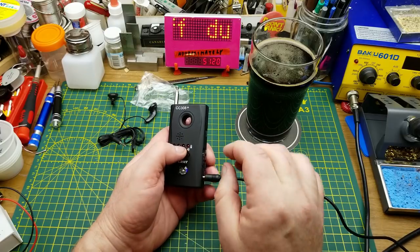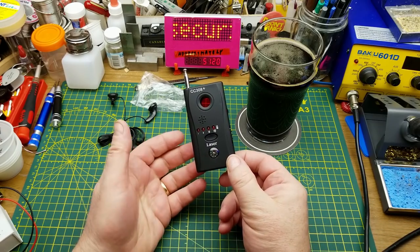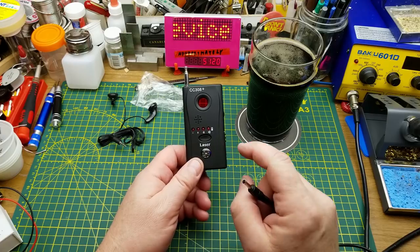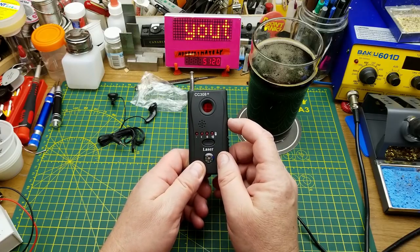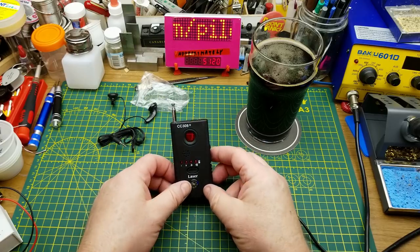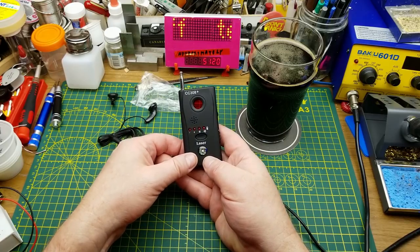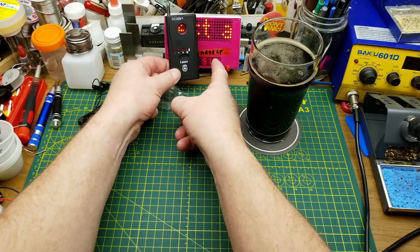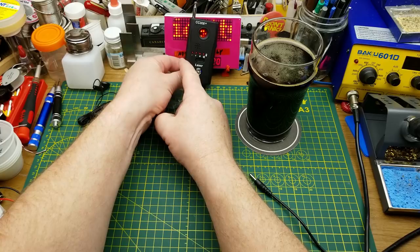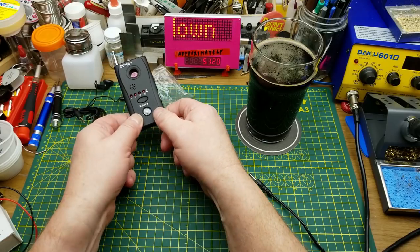When it's plugged into its charger and I turn it on, it's detecting full tilt. When I unplug the charger it calms right down — so its own charger is either noisy enough to upset the detector, or the detector is not very selective. You can change the sensitivity. I'll turn it down so it's not detecting my hand, because that's one thing it does seem to do. Near a Wi-Fi radio device it's clicking occasionally, but then it detects off my bottle of alcohol too.